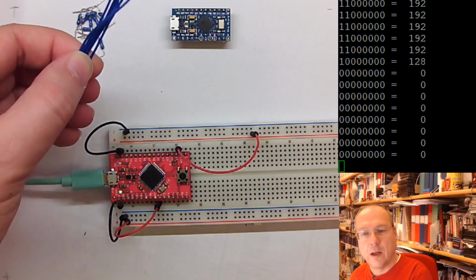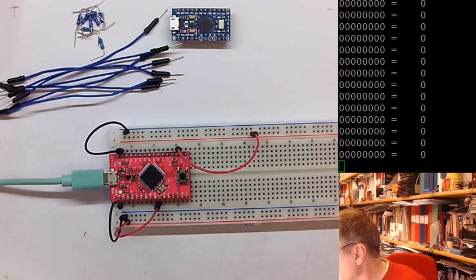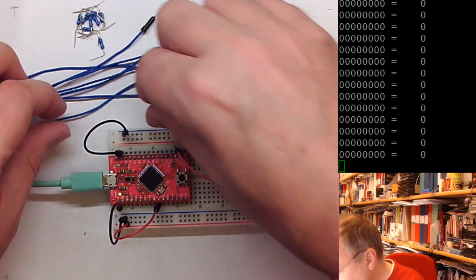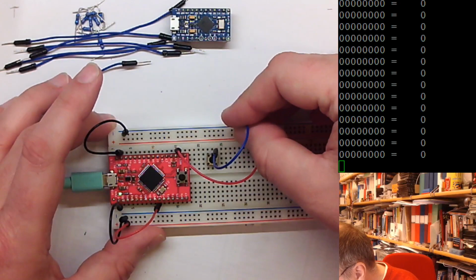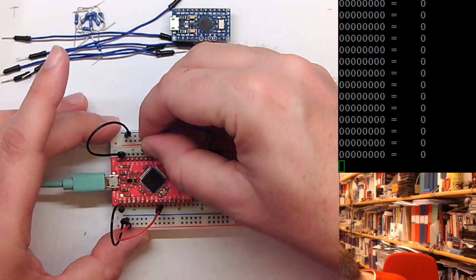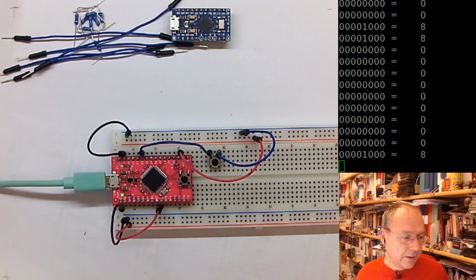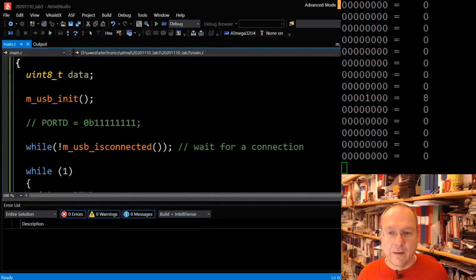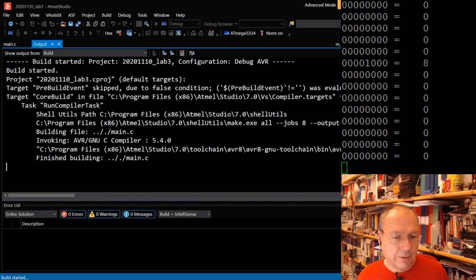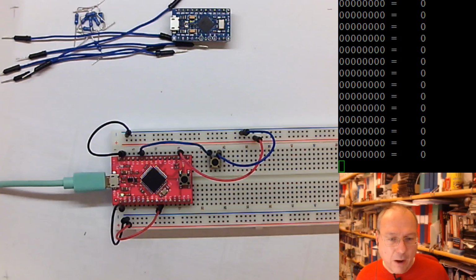For example, also by our switches, which you will find in your box. These are small push buttons. And how do they work? They are not in the description for this lab yet, but for the next one we will see them. So I connect one side of the switch to ground and the other side to one of the pins on the input of our microcontroller. I will try to re-upload the code with the pull-up resistors activated. So I get rid of the comment here, recompile the code, and hopefully I'm now able to just upload the code.